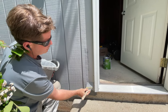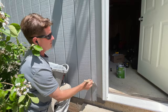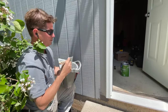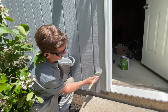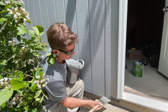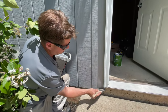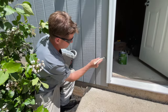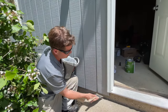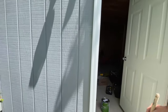And if you're a painter and you're using a brush, that's going to make a huge difference in your productivity and the final result, because now you're going to get a uniform sheen. And again, whenever you glide on top of the surface, you're not going to ruin your paintbrush. Another thing, if you just used the Rejuvenate right on top of this T111, you would get paint drag, and that would ruin your paintbrush. So that's going to take care of that. And if you want, the camera can get in closer there to see the surface up close.